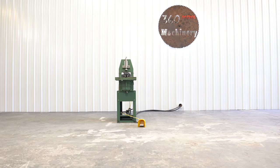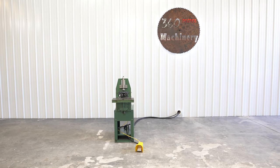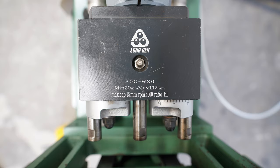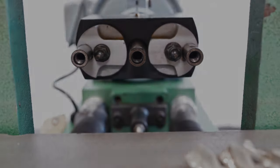We're going to do a walkthrough of a Grizzly G4185 3-spindle horizontal boring machine. This Grizzly 2 horsepower G4185 sports a three spindle G5953 boring head. The center spindle is fixed while both left and right spindles allow for indexing.